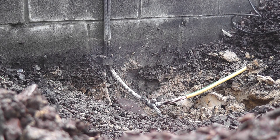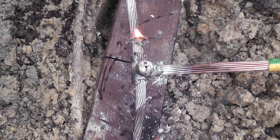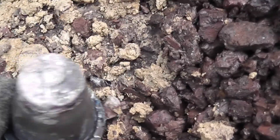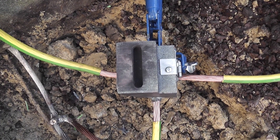It's taken — all right? Good. That's a cadweld, copper to copper. It fuses the copper at over 1,085 degrees Celsius. Here we have the capsule and cartridges in. It melts through there — it's an exothermic reaction I think. Very hot. Here we've got the next T joint.